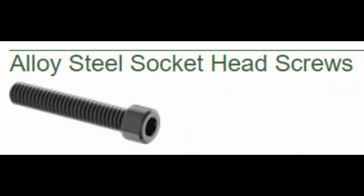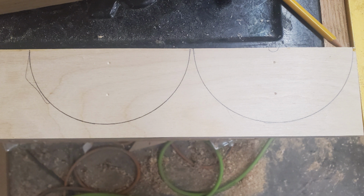The specs for my VicMarc VM120 chuck are printed on my template. You would need the specs for your jaws. I need M6 socket head screws 10 or 12 millimeters long. Buy some spares. I trace the template onto half-inch Baltic birch plywood. A center punch marks the bolt holes and provides a dimple to start the drill.